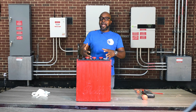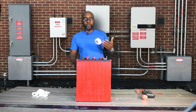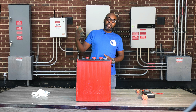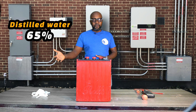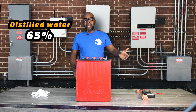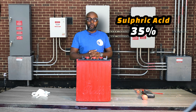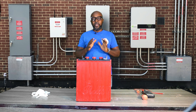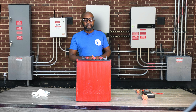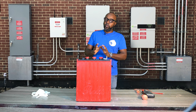A very good way you can test your tubular battery and your flooded lead acid battery is by testing the SG of the battery — the specific gravity of the battery. Essentially the liquid inside the cells of the battery is sulfuric acid mixed with distilled water. The distilled water is about 65% and the sulfuric acid is 35%. When both are mixed, you have what's called electrolyte, which is a very good conductor of electricity.